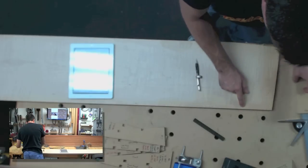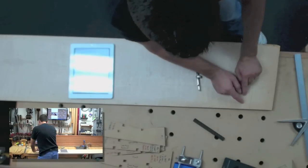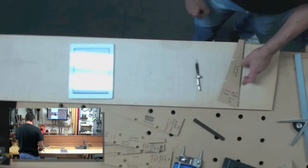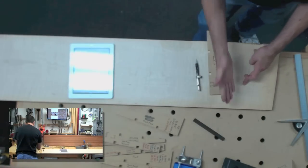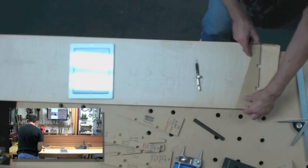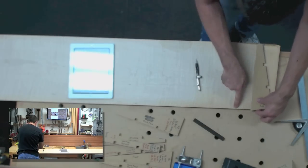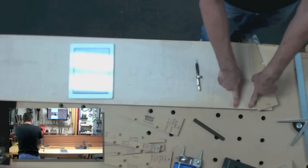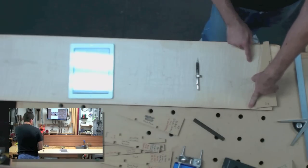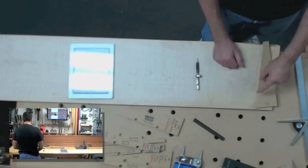So now I need the other angle for the other side. What I'm going to look for is a rear facet frontmost bevel. That would be this one here. This one here is not a negative angle, so I want it actually sloping into the inside. I want it tapering in, so that's actually this way here as well, starting from the mark that I made. This is the distance I care about. I'm only ever looking at the top reference surface. I don't care what the width is down here. That'll work itself out if I cut these things correctly.